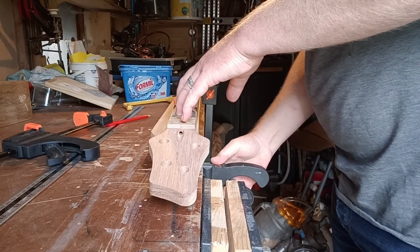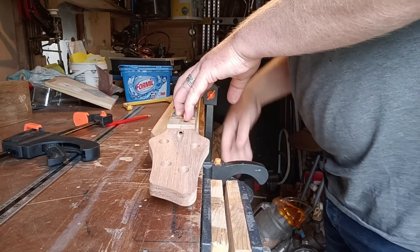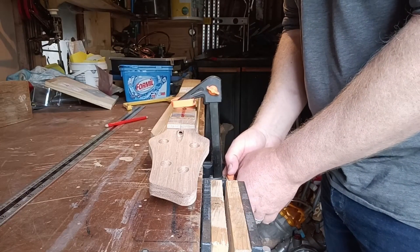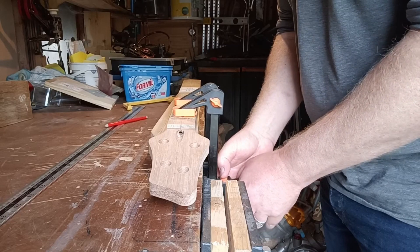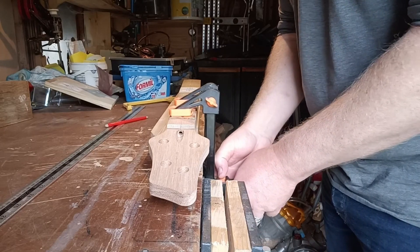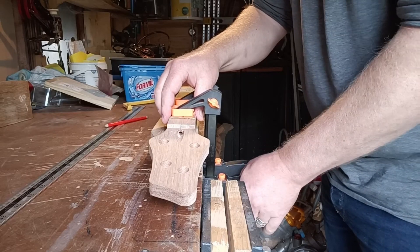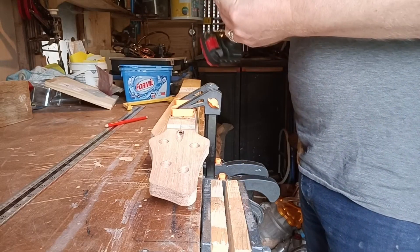The problem with this method is that if you use it without a guide, the drill bit can wander. So what I did was I drilled a matching size hole in a piece of aluminium and, as you can see here, I clamped it firmly to the fretboard. This worked remarkably well at keeping the fret-dot markers central on their appropriate points.